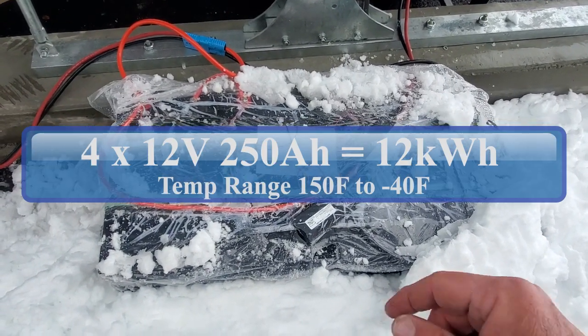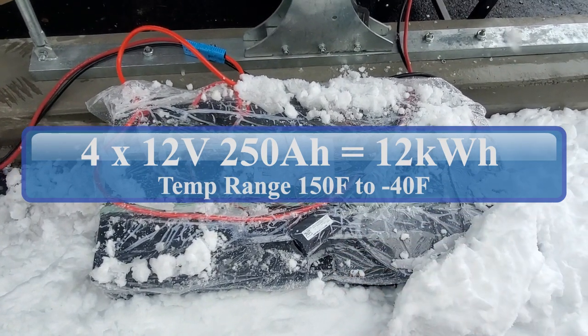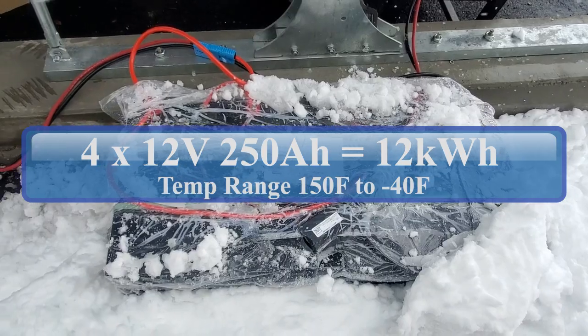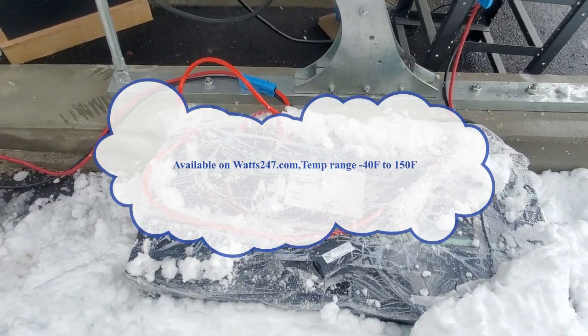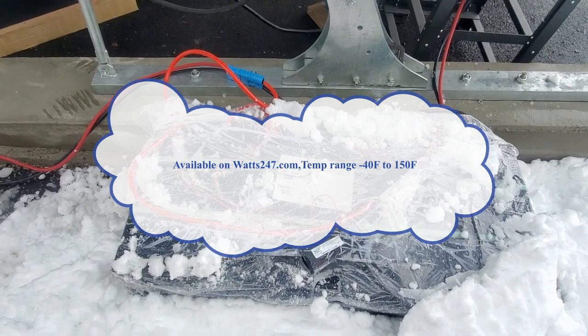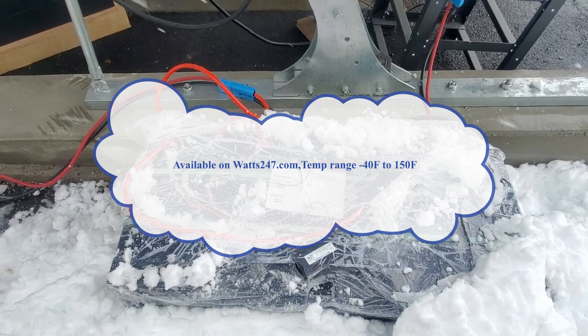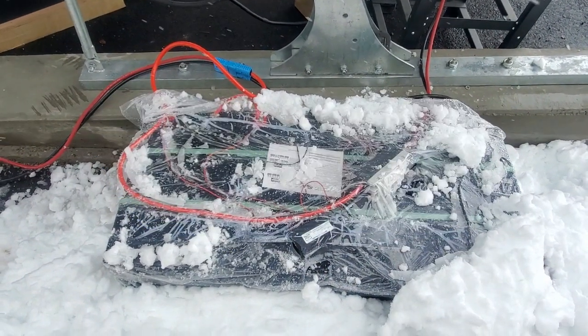So it's good, in my experience, to parallel these silicate gel batteries with your lithium batteries. They have exactly the same voltage range as a 16S battery, which most of these lithium batteries are. There are a few 15S and 14S batteries out there which have a lower charging voltage. So these are perfectly compatible with a 16S battery.